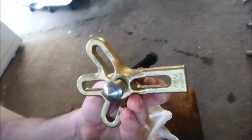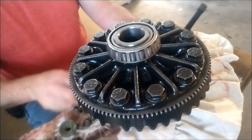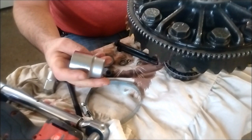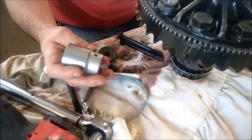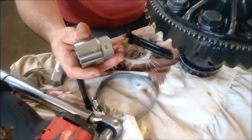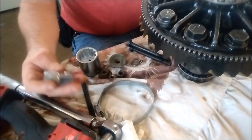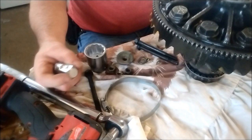What we have on hand is a crow's foot, which is a typical harmonic wheel balancer puller, or a steering wheel puller. We're going to use an O'Reilly socket — the same one we need for the pinion nut — that's an inch and five-sixteenths for a Dana 60 pinion nut. We're going to use the adapter to go from three-quarter inch drive to half-inch drive.